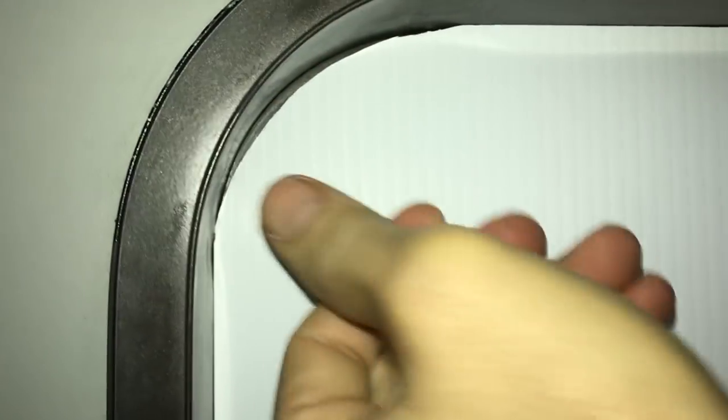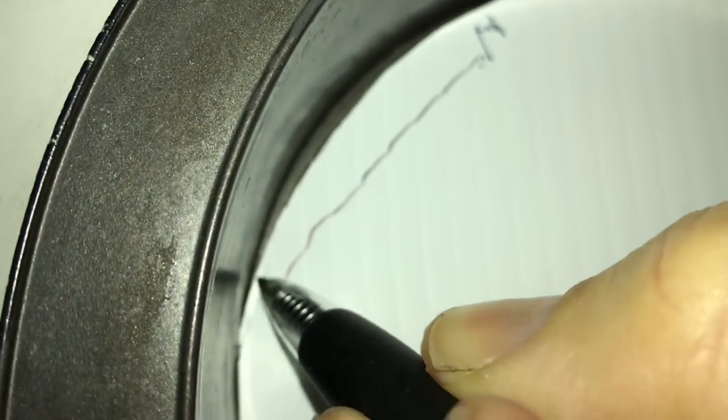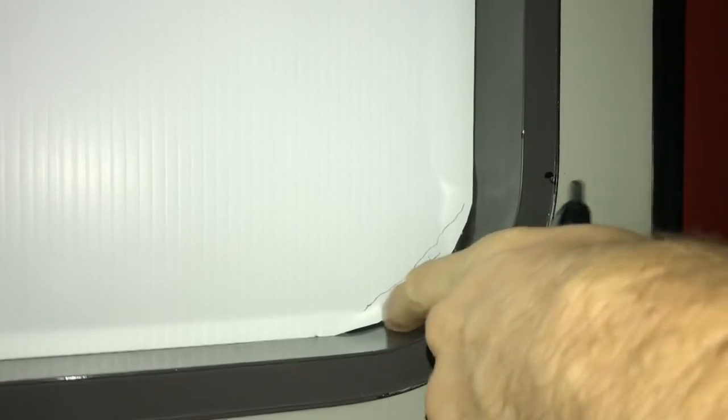We're going to fix for that in a next step. If it's a little too small or if you have a sliver of a light gap, that's absolutely no problem because we're going to add more layers to this edge that will fill in these gaps nicely. I can see this corner is actually probably pretty good. This one we need to add a little bit from here to here. The radius on this window wasn't exactly like the other one, but it's going to be close enough. If you're having buckling where the corner pushes in and an edge buckles up, trim a little bit there. Use your tab — you can see why you can't get it out without it.